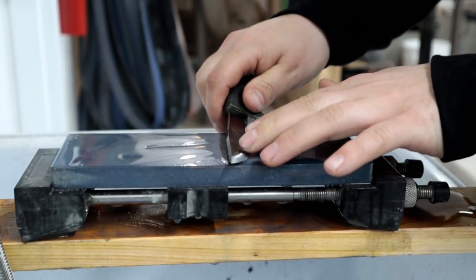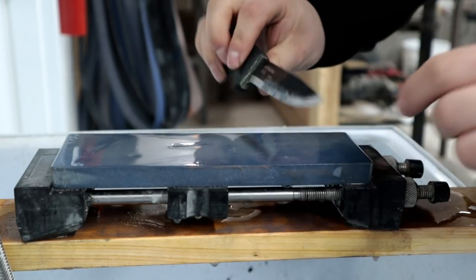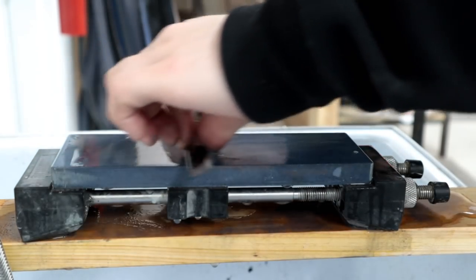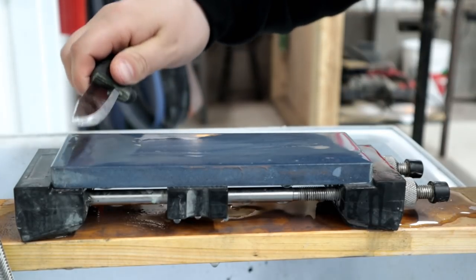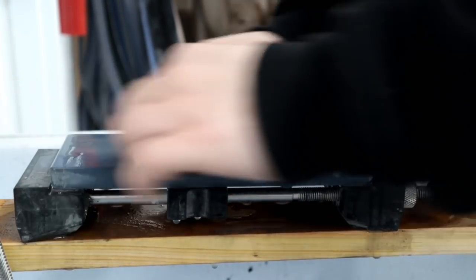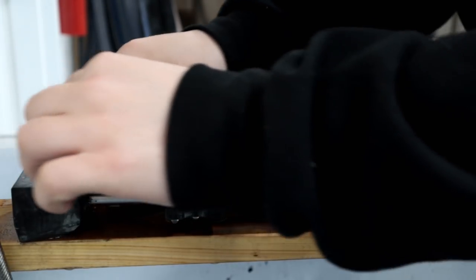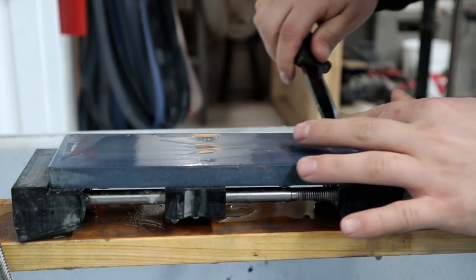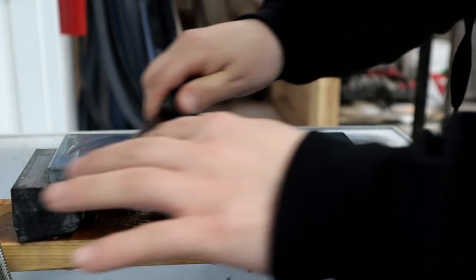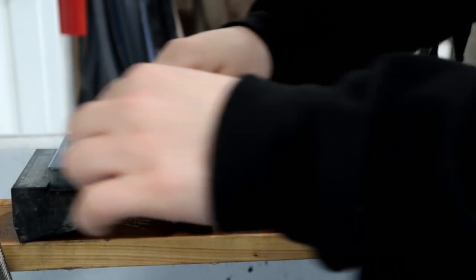Again, I always keep lots of weight down low on the bevel. If you keep up high, you're going to have a tendency to be convexing off of that primary bevel there. You don't want to do that. Lots of weight down low. Keep this hand driving down into your edge. This will make sure that you're not riding back and convexing as well. And once you get established on the stone and you start really creating that nice flat surface, it becomes easier and easier to stay there. Because that flat bevel just wants to lock onto your stone. Doesn't want to come off.